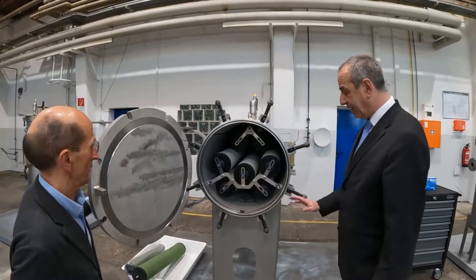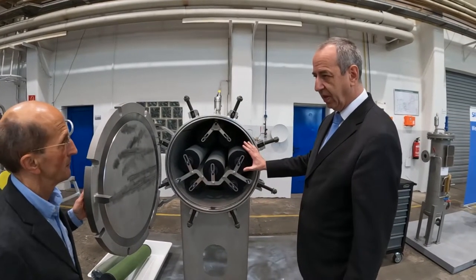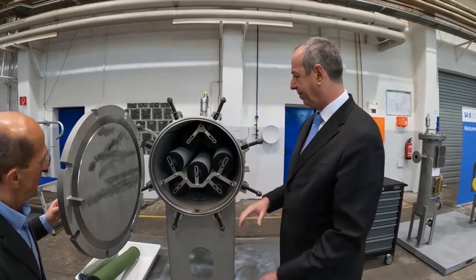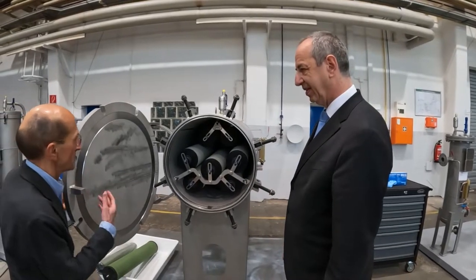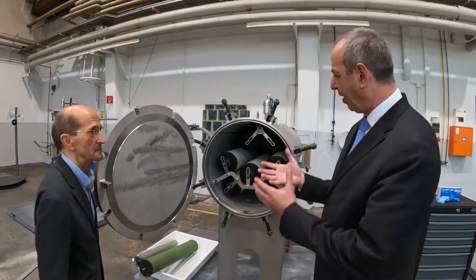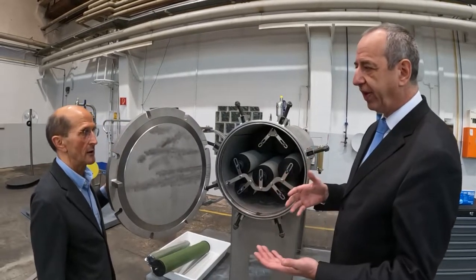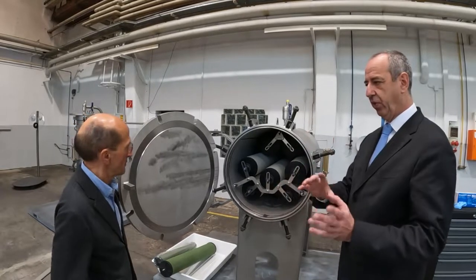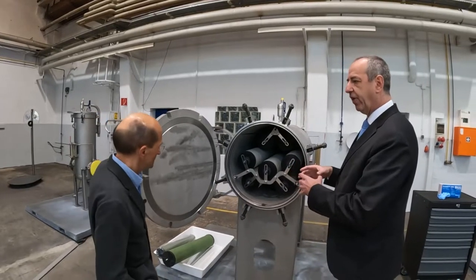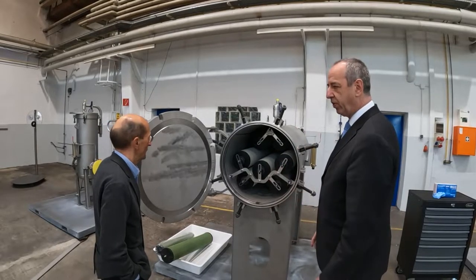This is a fixed facility setup, but the same setup would also be good for mobile equipment — it would look similar but have a different flow rate because the different requirements are according to EI 1581. People will be able to practice removing the elements, changing elements, finding out how difficult it is to screw them in and all the rest of it — touch, feel and work. So far our train-the-trainer concept was about doing training in a room and just showing people. Here everybody should be doing it, using the torque wrench and all the tools which are here.